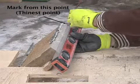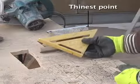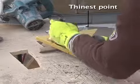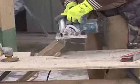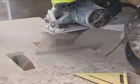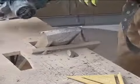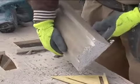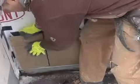Now you will mark your molding with the line horizontal to the thinnest part of your molding, as seen in these examples. You may have to adjust the depth on the drop leaf depending on your molding length. Now cut across like you would any other drop leaf molding. Note, you will want to cut slowly to avoid your molding from chipping out on the face. You may grind this edge a bit if needed. Now install your corner piece.